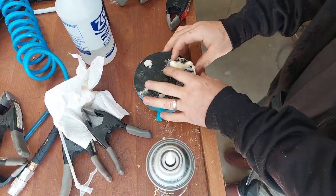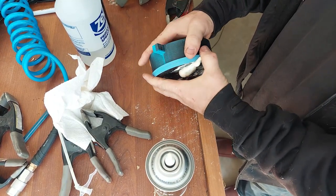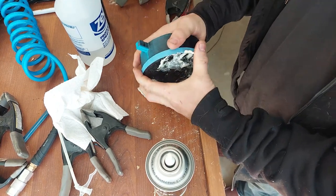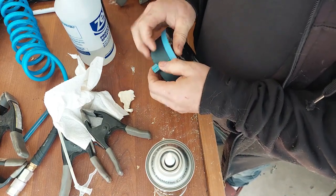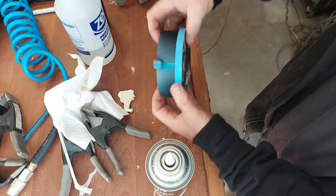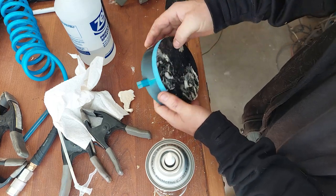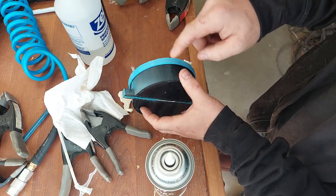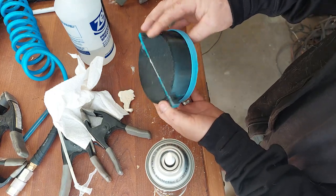The mold actually came out not so good so I had to redesign it with a split mold. I sprayed in some expanding foam and used some release material — PVA and wax — and it didn't seem to work. I had locked this thing in place, which was dumb. I had to pull it off in order to split it apart, but I can't pull it off without splitting it apart first. So I had to take the rim off the outside, which I just reprinted, so I could pull these apart.